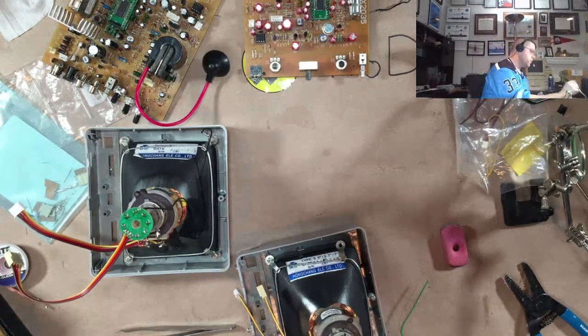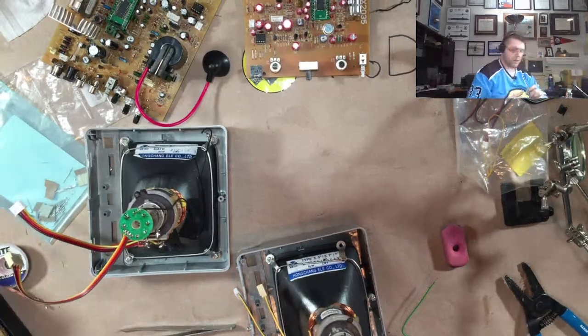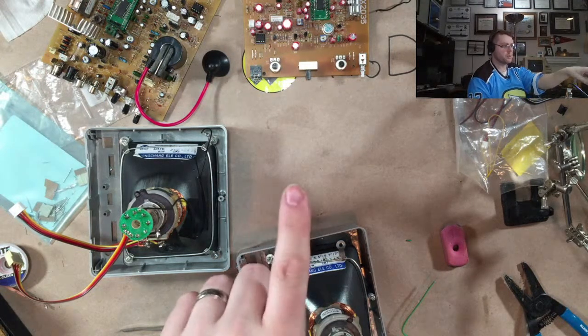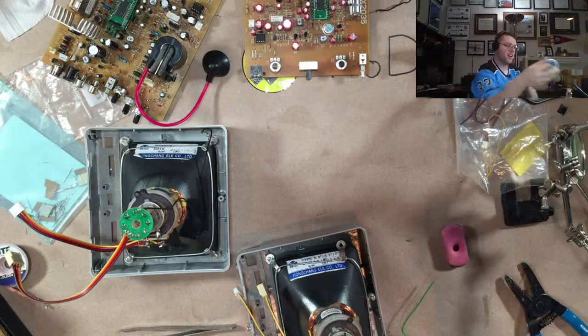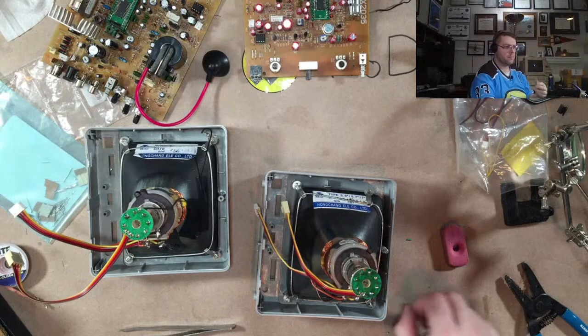But anyway, Tom, if you watched my video on my 2600 that I restored, I got it as non-working, and it was weird, right? Power was good. I had a known power supply that worked, known carts, I tested another 2600. And yeah, don't subscribe to that one. Subscribe to RealChef_Tom. Do that. But it turned out somebody harvested the timing crystal from that 2600, and that's why it didn't work.